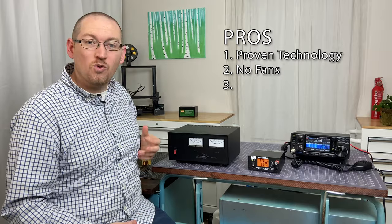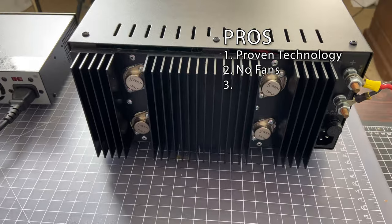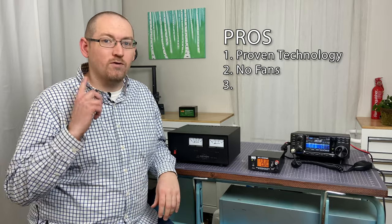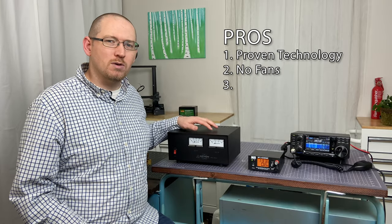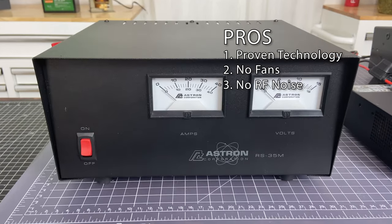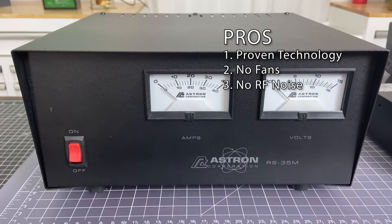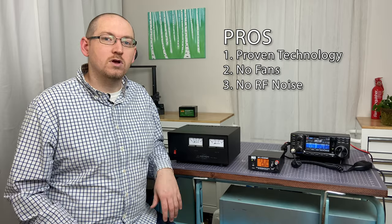Using really large heat sinks, it's just quiet in terms of audible noise. There really isn't any, unless you get into some models that are probably up around 70 or 80 amps — you really just don't have any fans, so they're very nice and quiet. The other thing is that they generate no RF noise. When you're using your radio, they should be generating no spurious emissions that would increase your noise floor or obstruct your experience in any way.